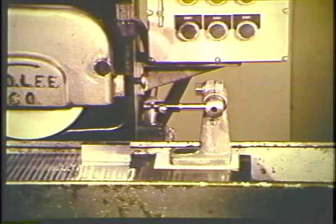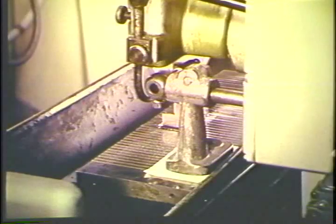Clean off the chuck and install a dressing diamond on it. For this example, a horizontal dresser is being used. Relieve the side of the grinding wheel. Start at a point about 1/16 of an inch from the outer edge of the wheel on the grinding side and go high enough to permit the wheel to clear the surface of the work you are going to grind.